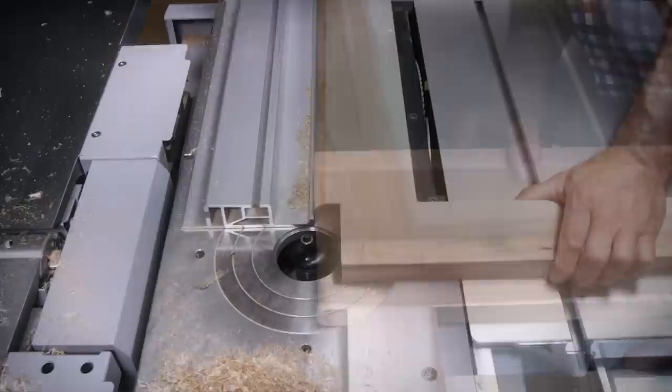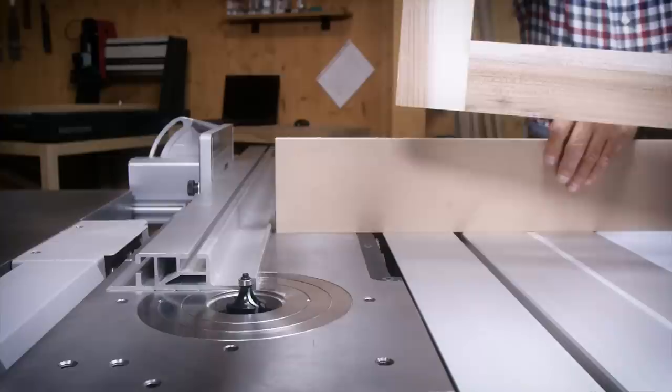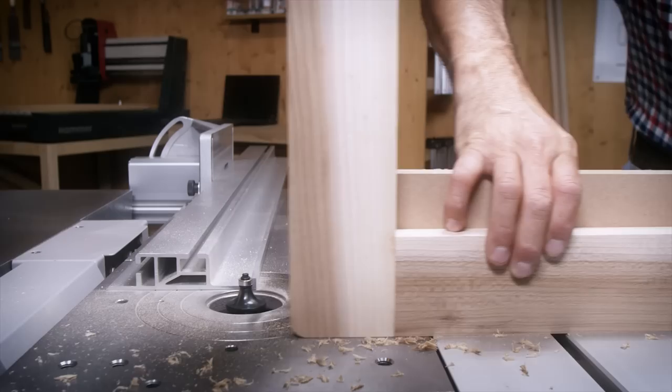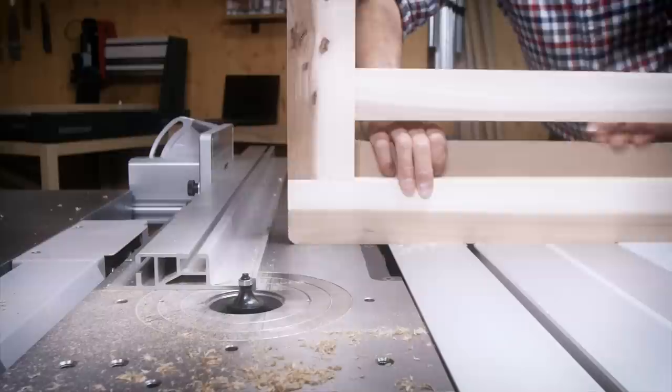During this process, we also continue milling the desired outer curvature on the seat and the backrest. A great advantage when using the molder spindle is being able to work in combination with the sliding table. The workpiece is guided consistently and safely as shown here, vertically aligned and backed with a sacrificial board to protect from tearing. The rip fence ensures that the workpiece is guided all the way to the guide bearing.